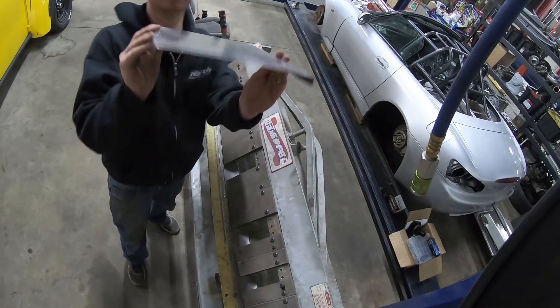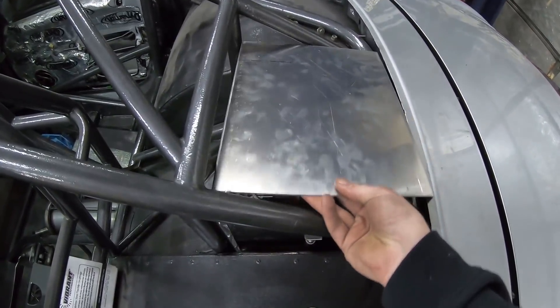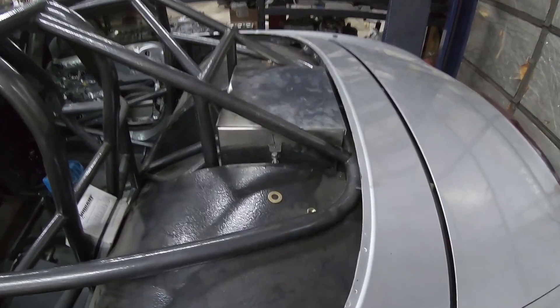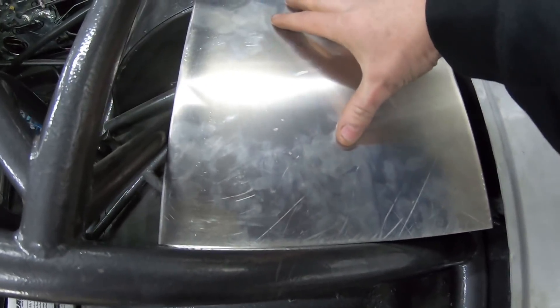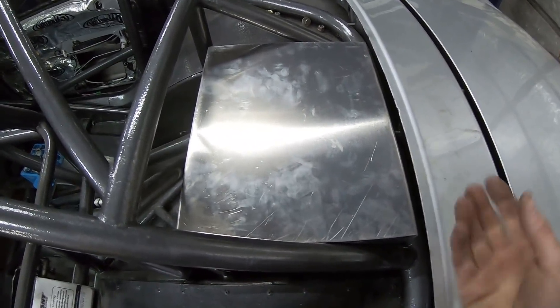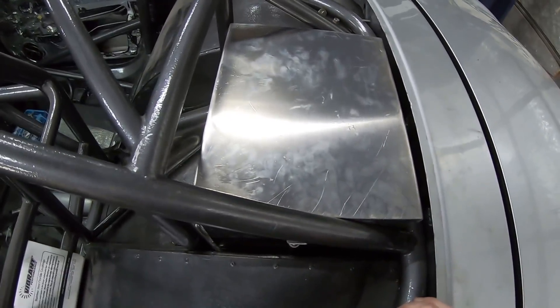That bent in just a little far, but boom - it fits. On the strap I'm going to weld a couple of quick-lock posts so it'll have push-button quick locks to hold the lid down tight. The edges will be lined with single-sided window-mold foam to keep the box sealed and keep any battery gases out of the driver's compartment.